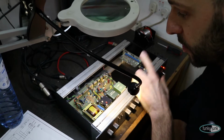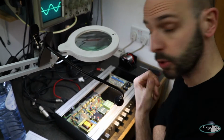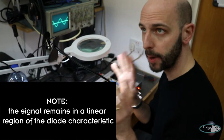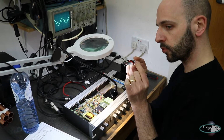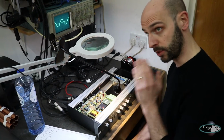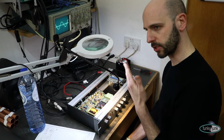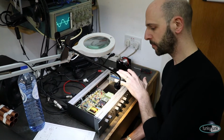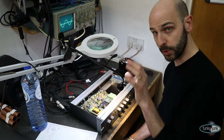This is a Diode Bridge compressor, so instead of using a FET or a VCA element to compress, so to reduce the gain of a signal, it's using the non-linear part of a diode, which is an NP junction, to reduce the gain of a signal. They started with the 2252, which then turns into 2253, and then 2254, 2262, 2264, 33609, 33610, and so forth. They all share the same characteristics, but there are ever so slight differences between them all.